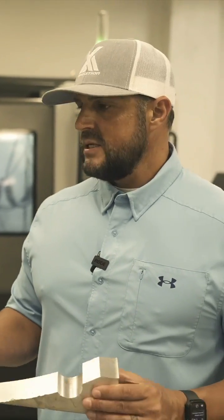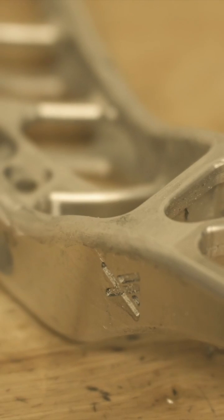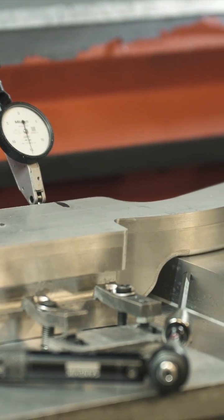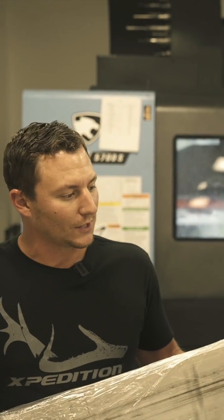It's like a magnesium composite. When you say magnesium, people think of MIM magnesium — when things are cast, it's porous, it's lighter, but it's brittle. Why is this so strong for our riser? Because of the extrusion process to make this billet, you will see no porous areas in there. It turns into a solid piece.